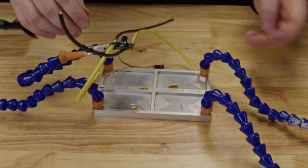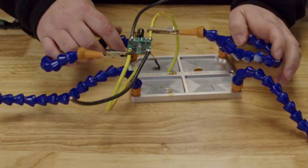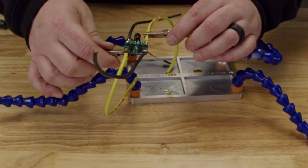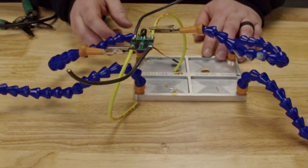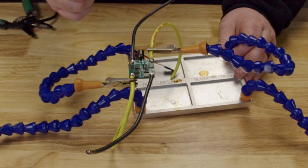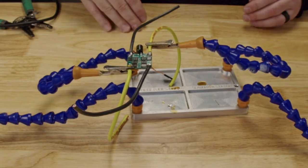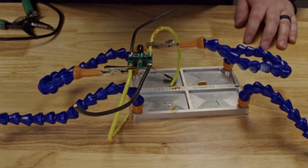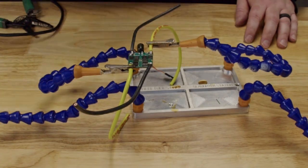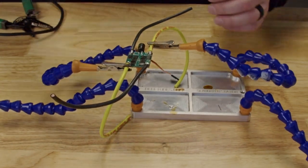Then I would probably crimp another one over here like this, so it would sit good and level. And then I would conformal coat this side, so you guys can see how this holds it. I would do a coat of conformal coat, let it dry, do whatever you're doing the rest of the day, come back and then do another coat. Just trying to make sure you're good and clear. Yep, do another coat. I usually do 2 to 3 coats per side,